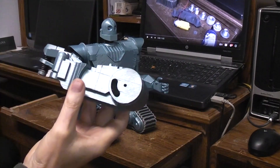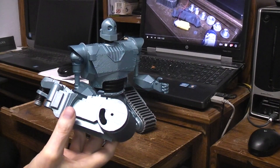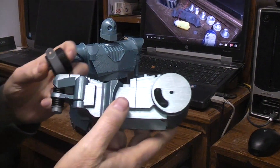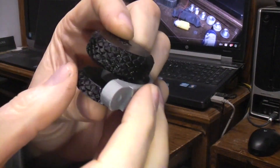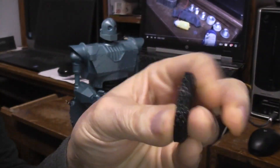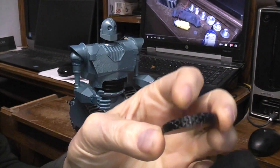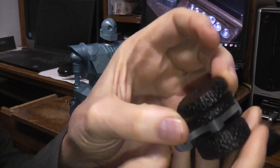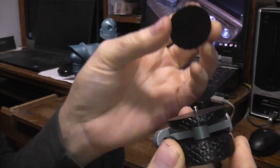As far as the rear part goes, I had to design my own rudder. The wheels I did find on Thingiverse — I really like the way they turned out. I printed them in TPU, the flexible filament. They're rather stiff because my TPU when it gets this thick it's pretty stiff. Basically I glue the two halves together with superglue because it's TPU.